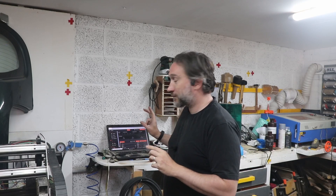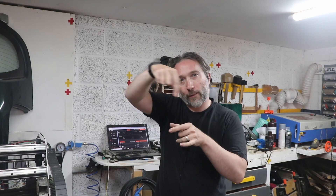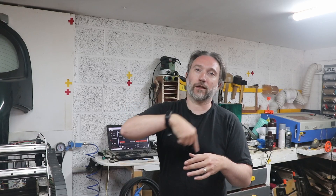Just a quick job upstairs on the CAD. I now have two jobs. One is going to cut a 60mm circle - it's going to ramp down to full depth, so it won't just plunge straight because that doesn't work very well with end mills. It's going to ramp down in one smooth arc to cut out a circle and leave some tabs. The other job is going to create a cog kind of pattern on the outside of that. That will clear the edge of the material for the lead-in and then just pull in from the side at full depth and cut around, leaving some tabs. That's the theory. A bit more complicated, but let's give it a go.